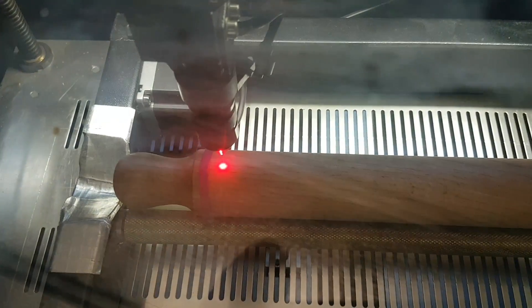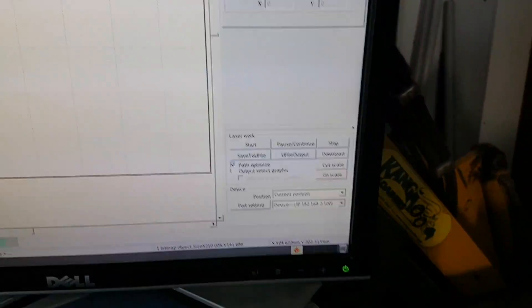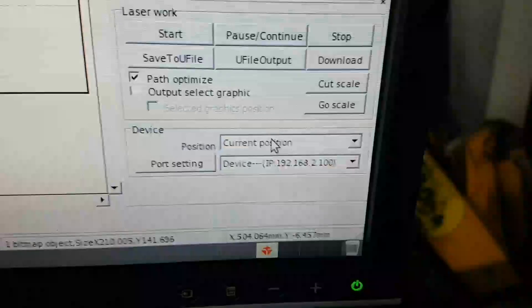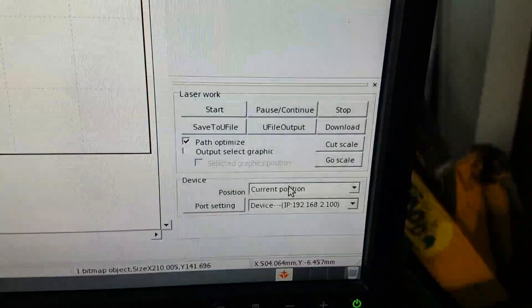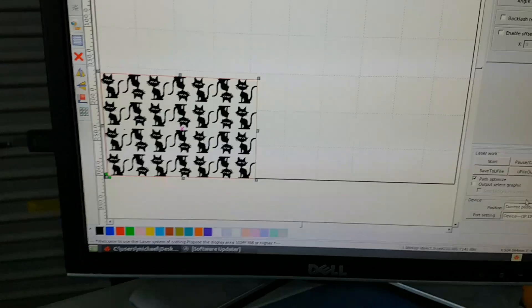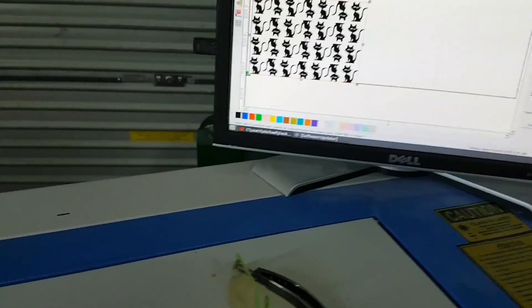Press Origin to make sure the location we're at right now is our home position. I've also checked the height off the cylinder. The next important thing is to make sure the machine is referring to our current position — otherwise it'll run off trying to use the table positioning. With a bit of luck that should be correct.